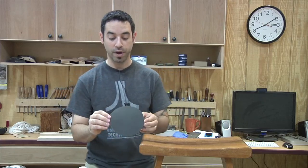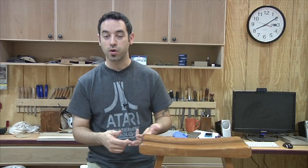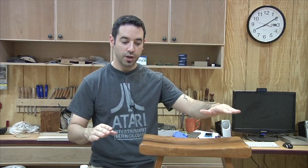All right, the key is really a lubricant and some sort of abrasive. These foam pads I think are fantastic. Festool isn't the only one who makes them though. Mirka also makes some similar pads that you could use for this. You don't have to use mineral oil. You can actually just use mineral spirits alone. You could use water or maybe even just a little bit of dish soap in that water. And depending on the type of finish you're abrading, whether it's shellac or lacquer, or of course water-based finishes, you may want to vary the lubricant that you use. Either way, the whole point is to limit the friction and give you a nice, silky smooth finish with very little effort.